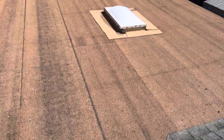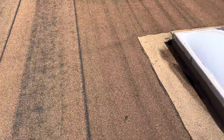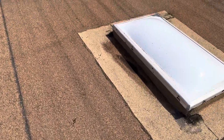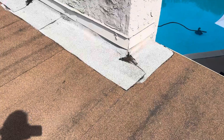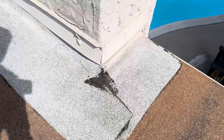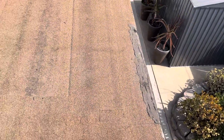Working over to the flat section, we've got some leaks coming from this area right here. You can see how water just sits and ponds in this portion of the roof — these are all granules from this torch down modified bitumen material. As that water sits, it ends up finding its way into the home. There was a repair that was done not too long ago, but obviously it's not doing the job because it started leaking when it started raining last year. All the granules on this torch down material have begun to deplete as well — just like the shingle product, once those granules deplete, that fiberglass becomes exposed. You can see how the seams are nice and shiny, and the waterproofing is greatly affected. We've got some major leaks coming from this section, and the intersection of this portion of the eave has a lot of wood rot as well, so it's been going on for quite some time.